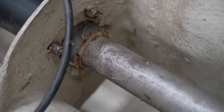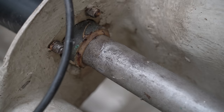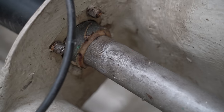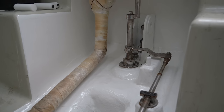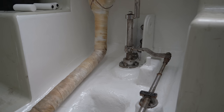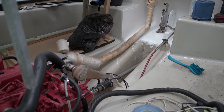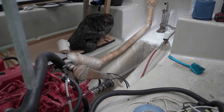The entire inside of the lifeboat was finished in fiberglass — both the hull itself and continuous moulded internal parts — all filled with buoyancy foam. Unsurprisingly the surface is therefore a gel coat, which is a usually pigmented layer of resin. It adds a fraction of a millimeter of glass fiber-free coating, rather like a paint, but it's applied at the time that the glass fiber is laminated. It's the most popular way that fiberglass parts are presented: durable, waterproof, and either smooth or textured for different uses.